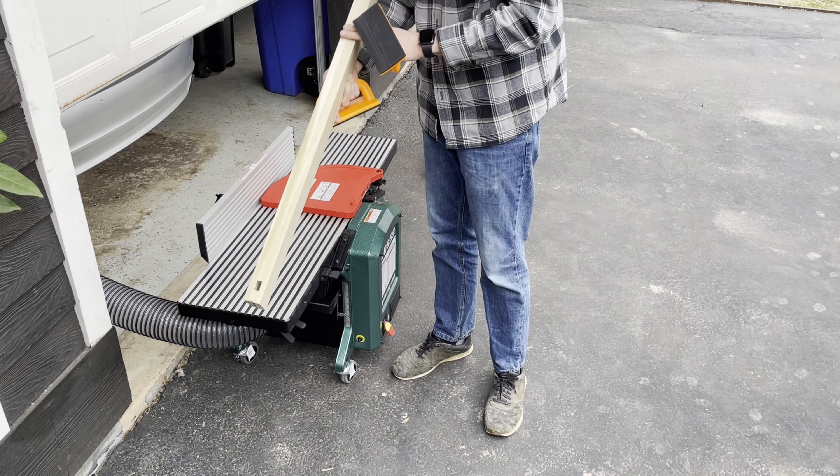Here I'm going to show how to convert it from jointer to planer mode. You have to take the dust collection hood off — it sits under and just gets pinched underneath. The biggest hassle is taking off the fence; it's four screws, but it's kind of annoying to have to do each time. Then get the guard out of the way and put the hood on top. There are two little tabs that go on the side whether it's in jointer or planer mode — it pushes in the same way and you need to engage those for it to work. In planer mode there's a screw you have to tie in; the other way it just gets pinched. After a couple tries I was able to get it — you can see it engaged as the rollers pull.